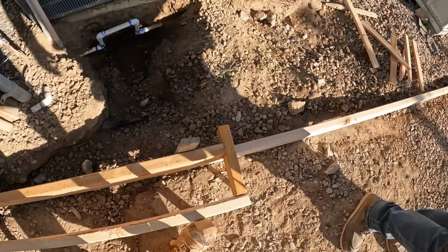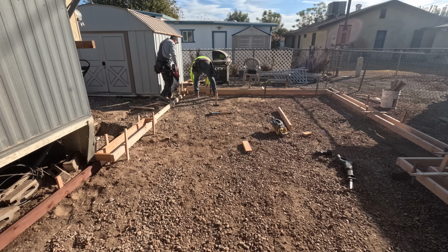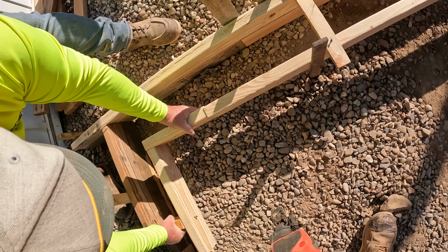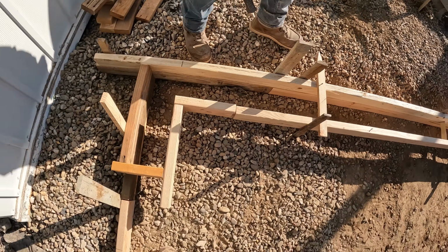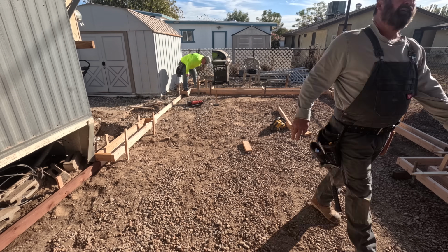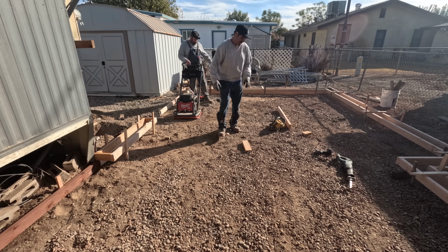Now the stem wall ends there because this is where an 8-foot door will be. We have a little return at the other end. So you have an 8-foot double swing right there. So if you didn't stop the stem wall, you'd be tripping over it going in and out of the door. That's why. Stop the stem wall at the doors.